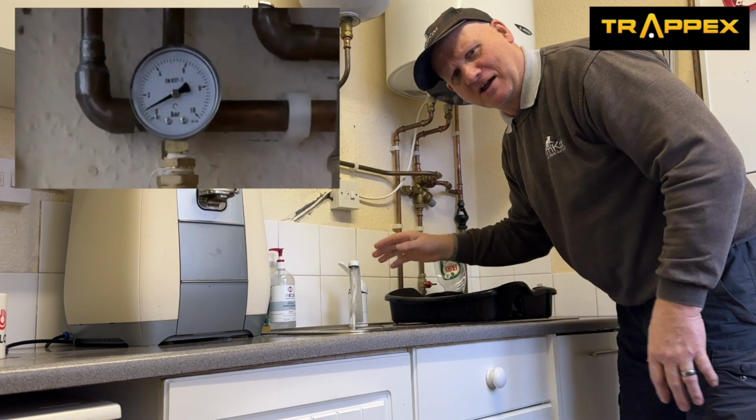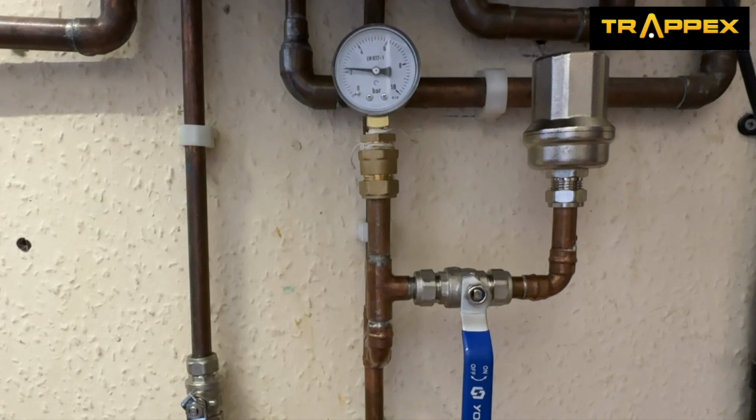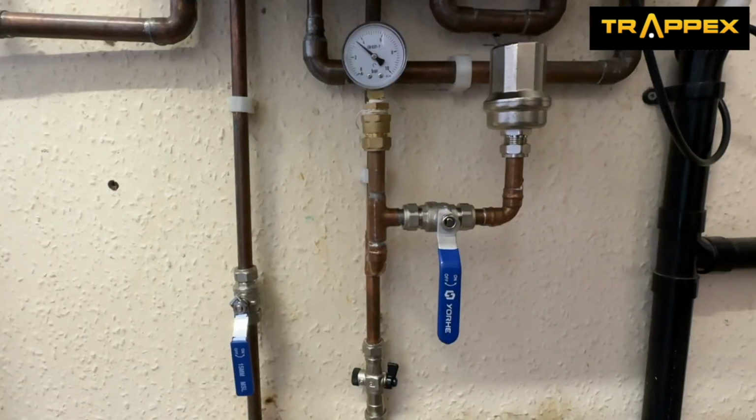It's like it's going everywhere. Our working pressure is just under a bar. So I'm going to let it get warm. Now I've got the hot water flow temperature at 60 degrees. So let's see when I close this lever valve, and I'm going to close it really quickly and see what happens. So you could see there was a jerk in the needle and it went back up to where it was before, just over 3.5 bar.